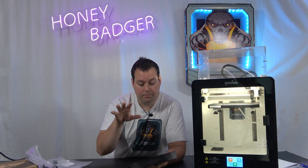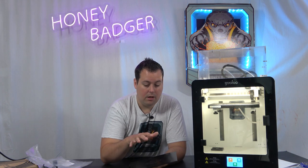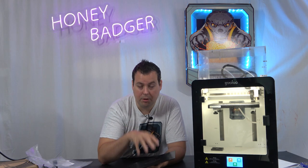I've had to use a few layers of hairspray on this, and for the vast majority of the materials that I printed, that seems to have been enough. However, when you start to move into engineering grade materials — your nylons, your PEEKs, your CPEs, and things like that — there are special conditions that are generally required to print really any of those materials. Generally speaking, you would set up a single machine specifically to print those parts, perfectly tuned for nylon, for example.